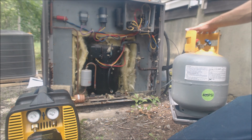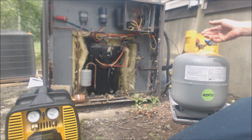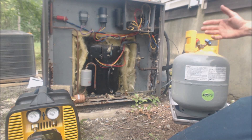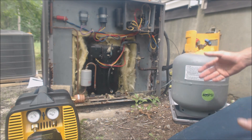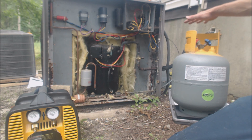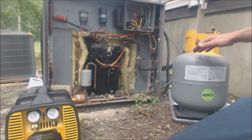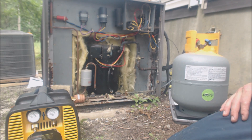Make sure that you do not mix the refrigerants in the same bottle, otherwise you get a fine for that with your supply house, because there's no way for them to recover the refrigerant — they actually have to burn it at the reclaim factory. You can't separate the refrigerants. So make sure that you keep all the same refrigerant in the same recovery bottle, and don't overfill the recovery bottles.